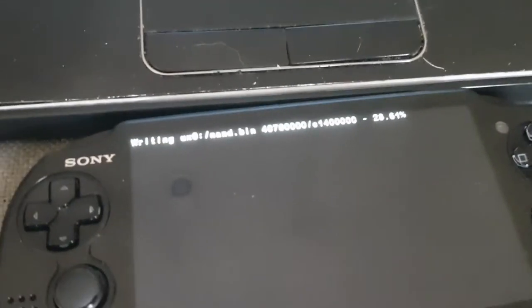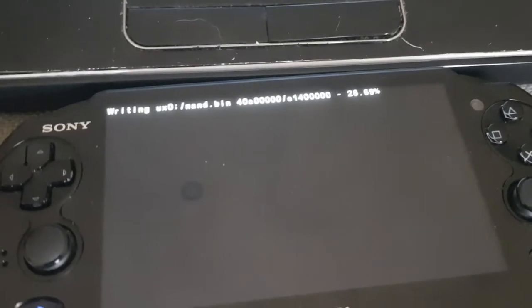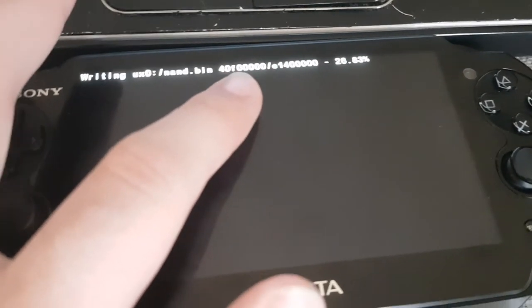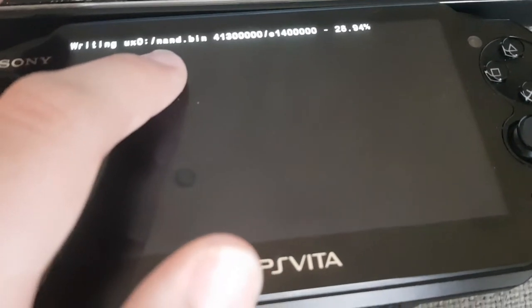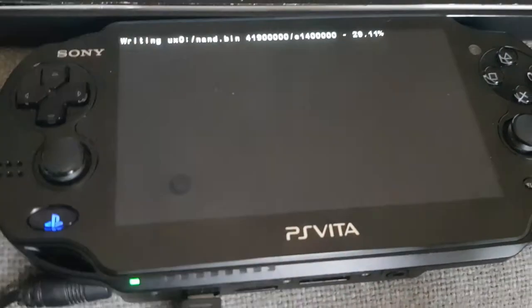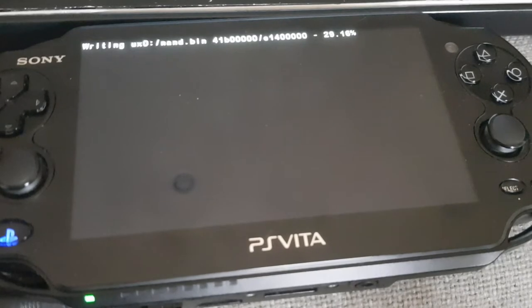So when I open it you should see it immediately start working. It can be quite hard to see, but I can see that it is reading some bytes and then writing them out to uxo-nand.bin. I have an SD reader in this dev kit right now, so that will be shared on the SD card.